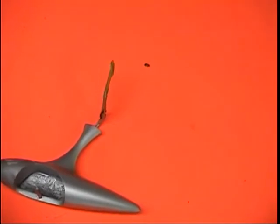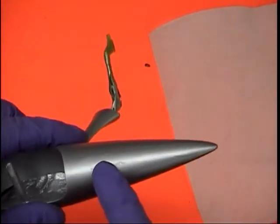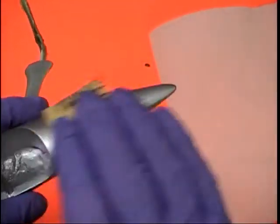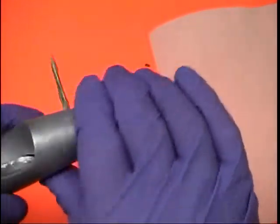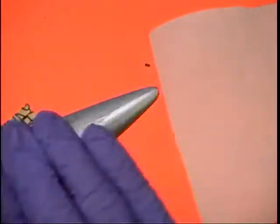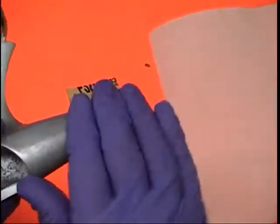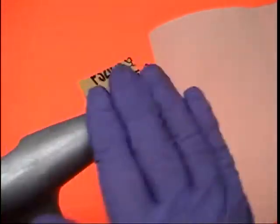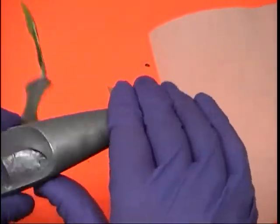Get a new sheet. Go to the next spot, which I can see right down here. I've got some pretty much the same thing. These are dry spots. These are spots where there isn't enough paint. Because what happened is in the final sand out, they were high spots. They were mountaintops. Every time I sanded it, I'd cut through and take away some of that material, and I'd be back down into raw wood. These in essence are mountaintops.